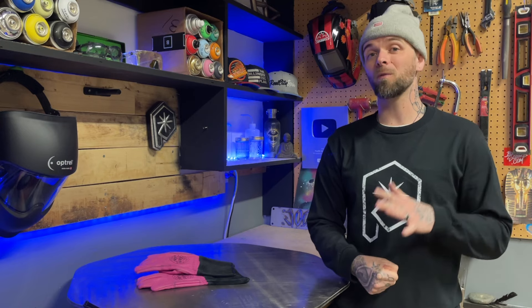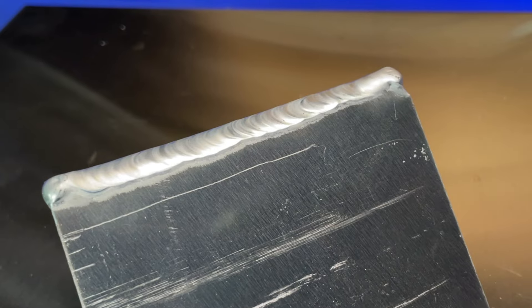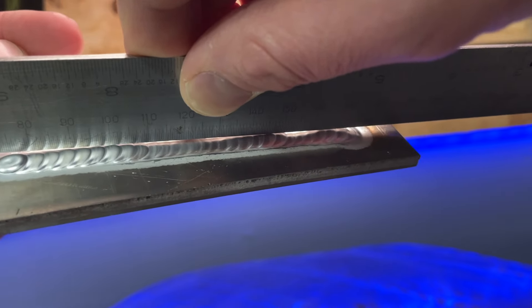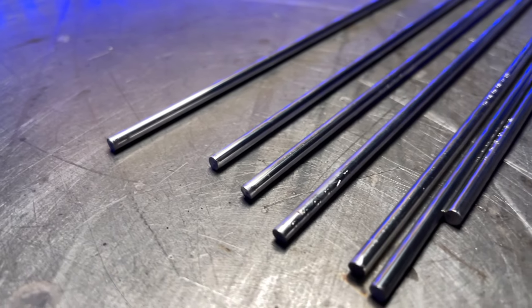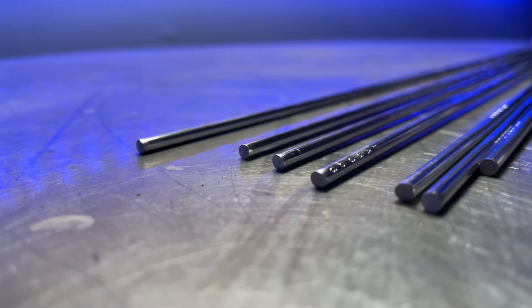What's one of the main things I talk about on my channel as far as something we want to eliminate or avoid with TIG welding? Excessive heat input. Excessive heat input is going to lead to all kinds of problems — it can cause severe overheating and burning through, and irregularities and inconsistencies to your overall profile and reinforcement. One of the most important things I teach my students in my online TIG welding program is how important filler material is to the equation. We can actually use these to soak up some of the heat.